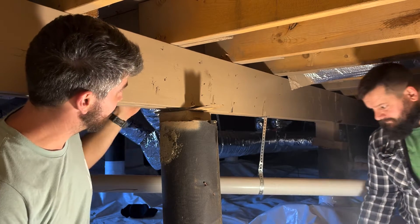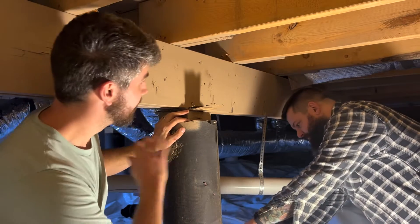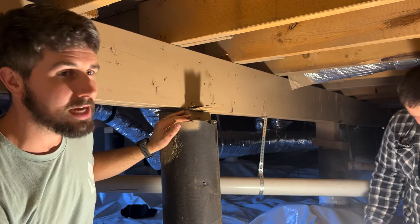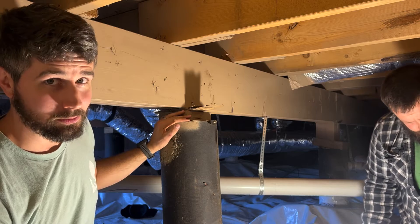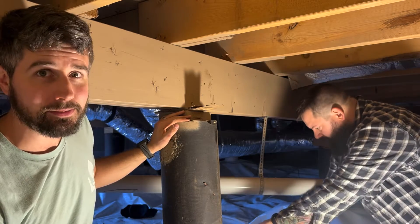What we have here are shims made of particle board, which compresses easily, especially under a house. So what we're going to do is take the pressure off of this shim with our handy dandy jack. What we use on this home is a 12-ton jack, which is going to be good for almost every home you're working on. We do have a 20-ton one that comes out if you really need it, but this is a two-story home and the 12-ton is going to do just fine.